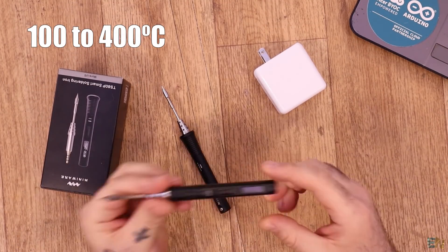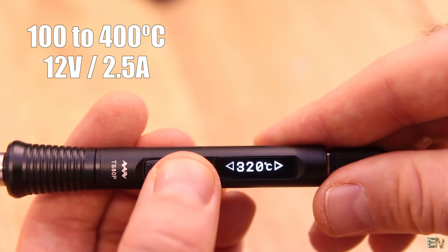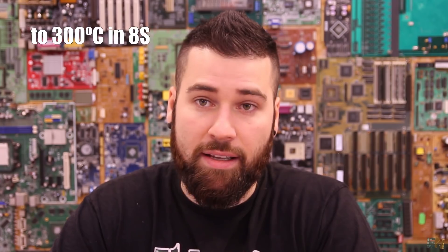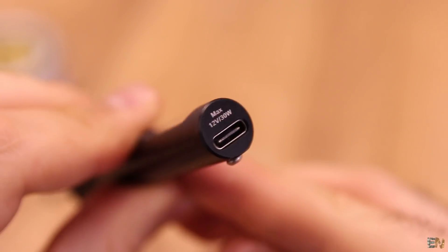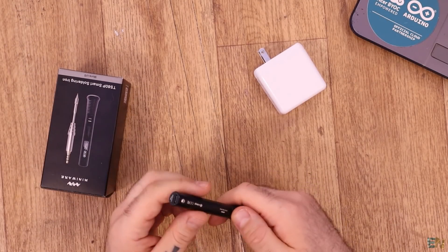Let's go through the specs. This has the same temperature range — from 100 to 400 degrees Celsius — same as the old version. It has an input of 12V and at 12V it will draw 2.5A maximum current, which equals 30W — that's 12W more than the TS-80. Remember, the TS-80 had 18W, so this will be a lot faster. From room temperature to 300 degrees it takes around 8 seconds. The data and power interface is USB Type-C, same as the other version, and because USB Type-C can take a lot of power, that's how we get 30W. The same USB input is also used for data.